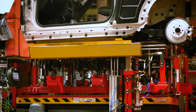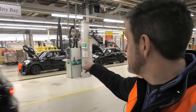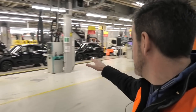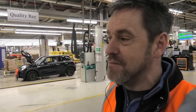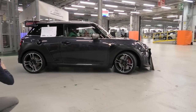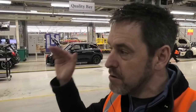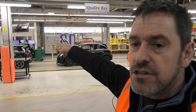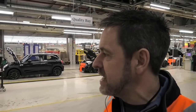The cars are now pretty much finished — the finish line is just there. We've got a John Cooper Works hatch followed by an electric Mini, and there's a Clubman just there too, so we've got a fantastic demonstration of the whole range. A GP was just being finished off when we arrived, and you'll see GP bits in the factory occasionally — they start proper production next week or the week after, but test cars are still going through. The cars go through final prep stages including a rolling road, an internal cobblestone test track, and an external test track. Notably, 60% of the Minis made here are exported — going by train to a port and then by container abroad.